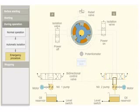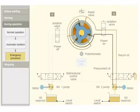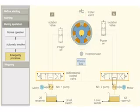For instance, when the right side lever is operated, the bidirectional control valve moves towards the right. The rotor in turn moves the rudder to the port side. When the desired rudder angle is achieved, the manual operator releases the lever and the valve comes back to its initial position.